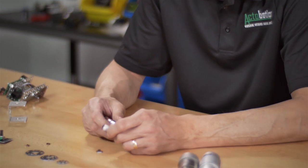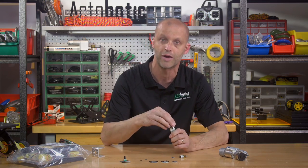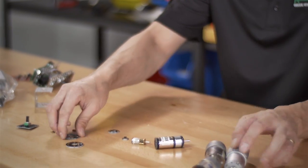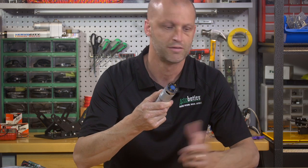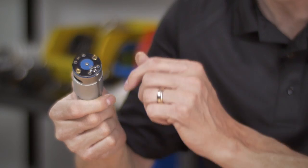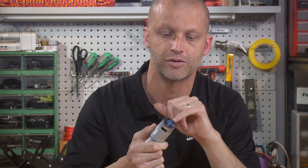These things are really cool. We use them all the time in our R&D department. Everybody out there that's watching has built a robot or built any kind of device — you're unsoldering wires off motors, soldering them around, changing them around, or trying to daisy chain motors to one another. It's a real pain. So we developed these little boards, as you can see here. They'll slip right on the back of any of our gear motors, as well as other manufacturers. Simply solder them — 0.100 header pins are already on the boards, pre-soldered. All you need to do is solder them on the back of your motor.